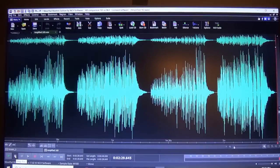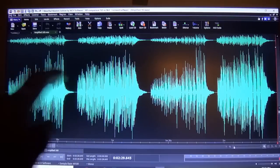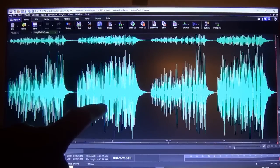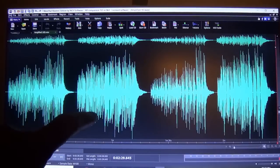I can't help but share a couple observations here. Naturally, you can draw your own conclusions, but I just thought I'd tell you my own. Number one, I think the spectrum here tells you a great deal. It looks to me like you're losing a lot of your mid-range and bass frequencies with the 165 circuit. If anything, however, you may get too much bass and mid-range with the 864 circuit. Amplifying the 165 really did not compensate.